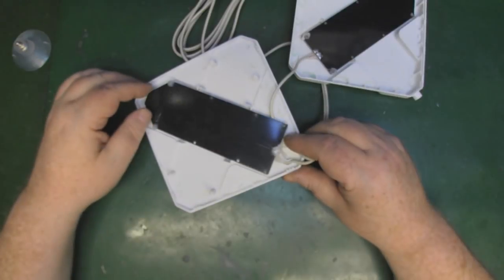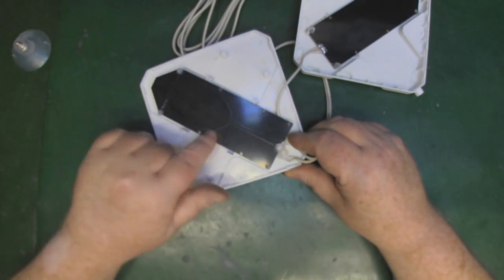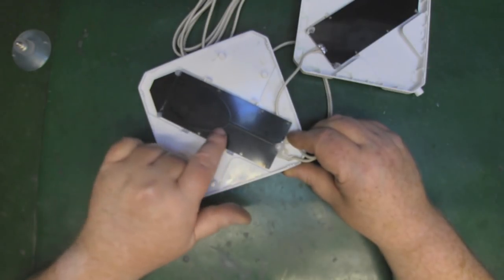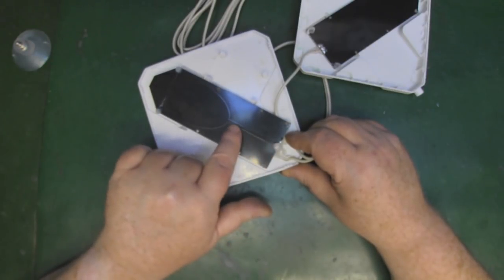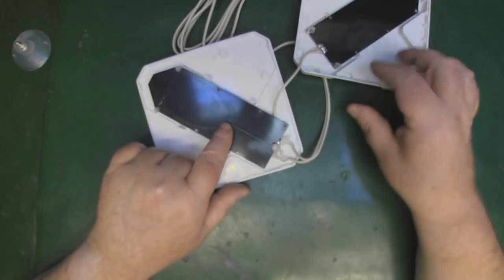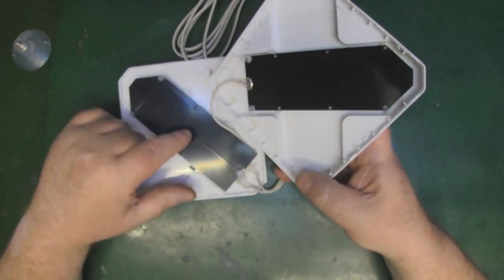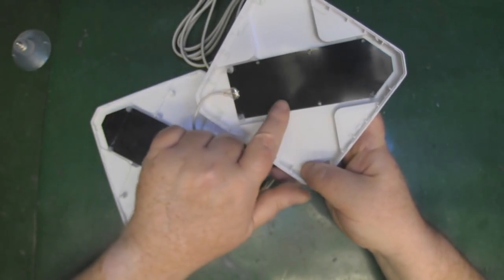Inside it's really simple — just two PCB boards. It's hard to see because of the black solder mask, but you can see the main driven element here. It's shaped like a spoon or paddle, quite wide and elliptical in this area, with a simple strip line feeding into it. On the opposite side of the PCB we have a square ground plane.